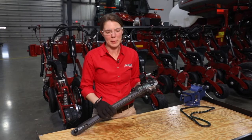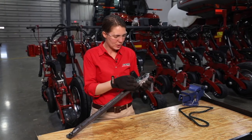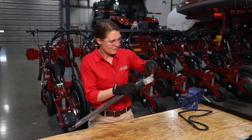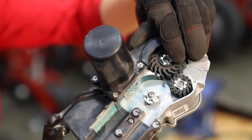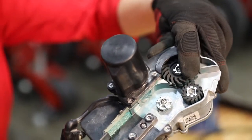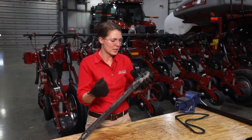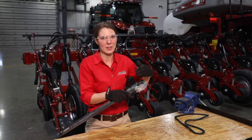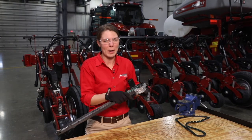The first maintenance item to look at on the speed tube are our two feeder wheels up top. We want to check whether the fingers of the larger feeder wheel fully engage with the fingers of the steel comb. We should have three fingers visible on that comb, with large enough fingers on the large feeder wheel to fully engage with it. The job of the comb is to remove any debris caught in the larger feeder wheel that could prevent it from taking in seed, so we want to make sure it is fully engaged.